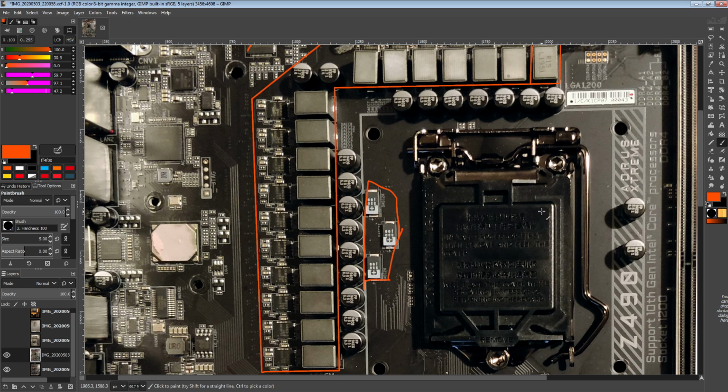So if you have a load insertion transient, you suddenly need to pull a bunch of current out of the capacitors, and if you have a bunch of inductance in between the capacitors and the CPU, which is where the ESL comes in, you're going to have a bigger voltage dip than if you had less ESL. Similarly, if you're dumping energy from the inductors into the output filtering capacitors on a load release transient, having a bunch of inductance on the capacitors means it takes more time to get that energy into the capacitors, and so you get a higher voltage spike on the output of the VRM.